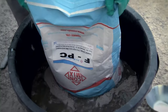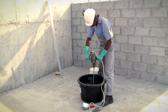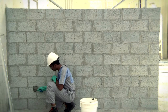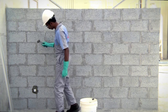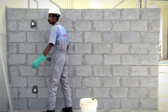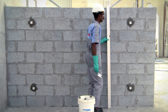To fix plaster points and corner beads, fitting plaster must be used. Plaster points are made as a guide to control plaster thickness and to ensure the plumb line. The adjacent points have to be placed with the help of a spirit level to achieve a right-angle vertical surface. Fixing corner beads helps in preventing mechanical damage to wall corners.